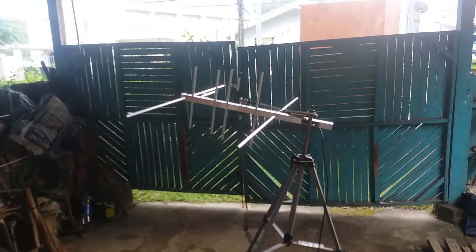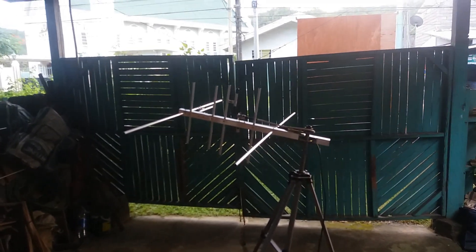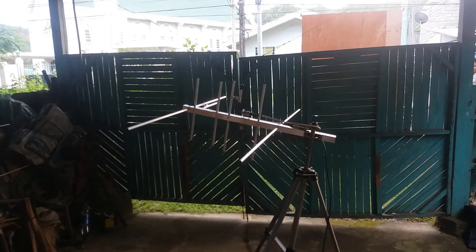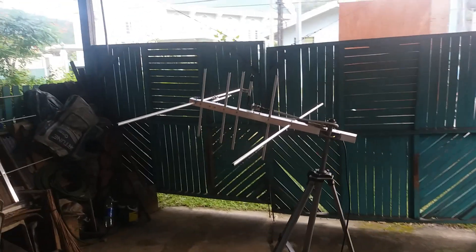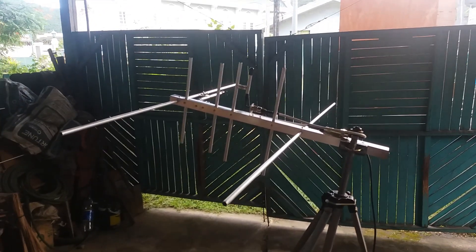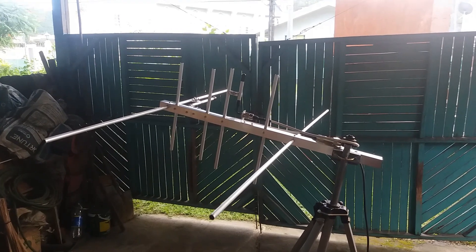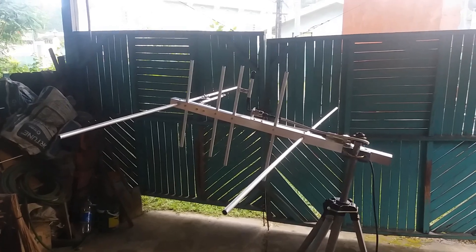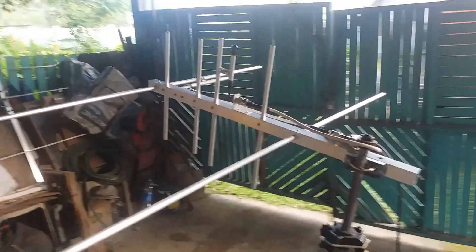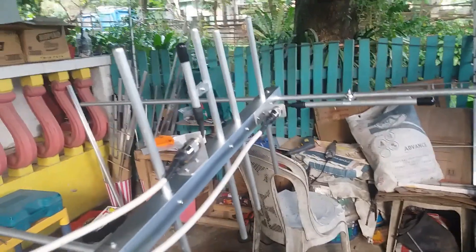Let's check the antenna configuration of this 2x4 cross element Yagi antenna designed for satellite operation. This has become one of my favorite antennas, not only because it's compact, but it exhibits good performance on both the VHF and UHF amateur bands. It is designed for 144 to 148 MHz on the VHF side and 430 to 440 MHz on the UHF side.